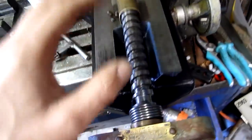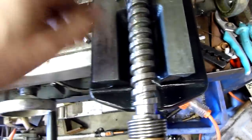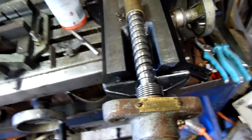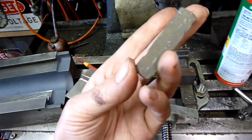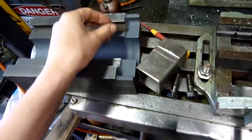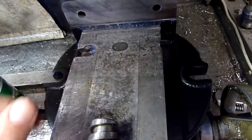After a bit of a lag in work on this vice, I really need to get it done. I'm going to strip it apart and see what condition it's in on the inside. I've soaked it in oil and it's nice and smooth now. I'll pull it apart anyway and probably polish the screw in the lathe just to get rid of some sharp spots and minimize chewing the brass nut out. Everything else is cleaned up alright — I've taken a honing stone to all these surfaces, gently honed with some spray oil, and it's taken the high spots off dings and dents. Pretty good.